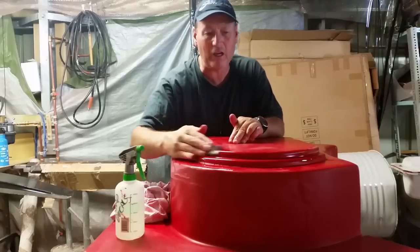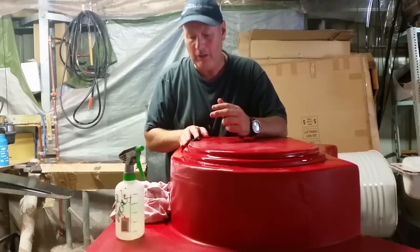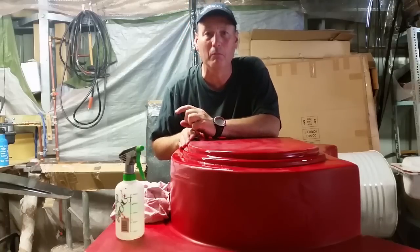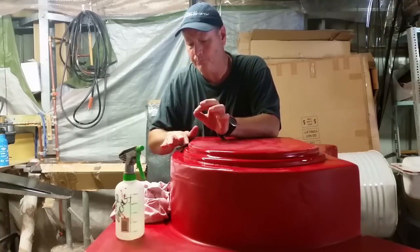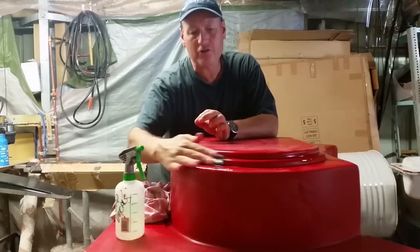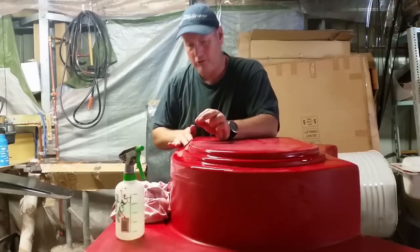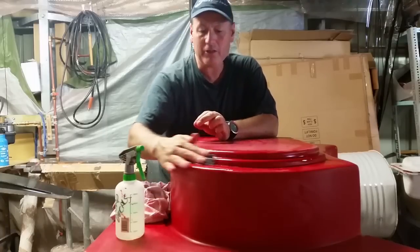But if I was actually sanding to remove material, then definitely I would use something like a flat surface or a foam pad that conforms to the curve of the mould. The issue with that is you may miss a spot, and obviously we want this to be a perfect finish, so we want a nice smooth curve all the way around, and restoring this mould could take a day to get this fella back to action.